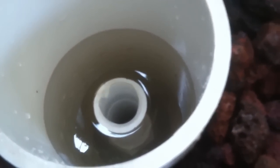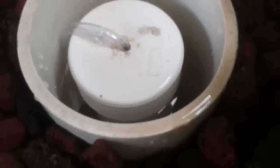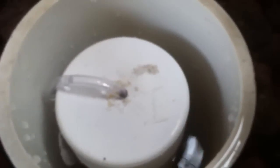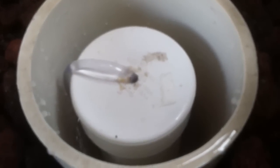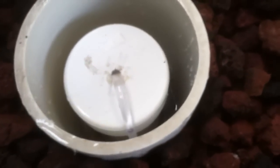As you can see here, we're refilling — water begins to run over the top of that tube. We'll drop our bell valve in here and watch the water level continue to rise. You'll see water instantly shoot through that clear tube once the siphon is in full swing. Watch that clear tube — you'll see all of the air escape out. The siphon's just begun, and it will drain back down until the water level is below the mouth of that clear tube, and the siphon will cease and the filling process will continue.